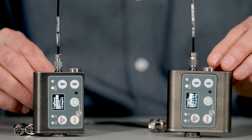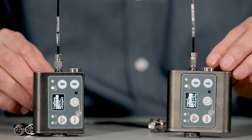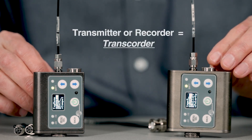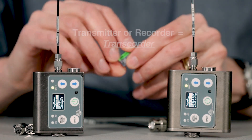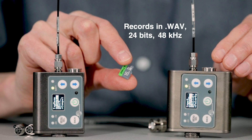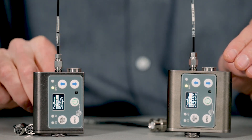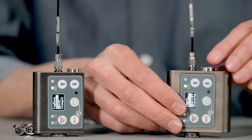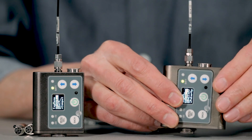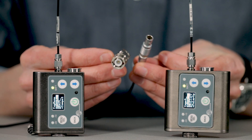Like the previous generation hybrid SMWB transmitters, the digital DBSM and DBSMD can be configured as either transmitters or recorders. Files are stored on micro SD card memory in the industry standard broadcast .wav format at 24 bits, 48k sample rate. For jam sync purposes, the TA5 mic line connector also acts as a time code input, and we've got adapter cables for this purpose — one with a Lemo 5 and one with the BNC.